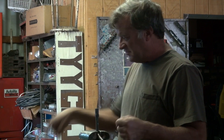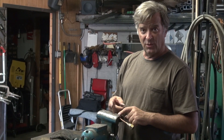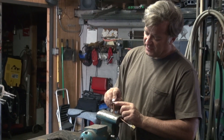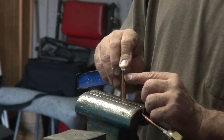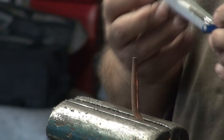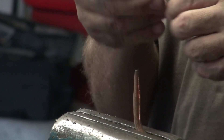You're good to go. You'll now have a nice clean flame on it again and you can get back to work. Let me just go ahead and do these other two while I've got it out, and then I'm going back to work. With the little welding tip, just run that file across the top of it, clean up the top real nice, and then pull out the right size cleaner.